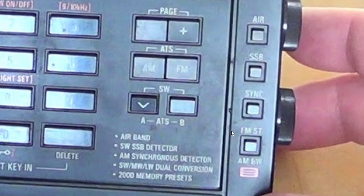The drawback of synchronous detection is that unfortunately not all implementations are equal — some radios are better than others. Sony receivers are known to be among the best for synchronous detection, and I believe Sony was one of the first brands to introduce it. The Tecsun PL680 is also really good at sync detection. Many radios don't have synchronous detection at all, so you may want to look at receivers that offer it — and remember that not all radios are equal in their implementation of synchronous detection.